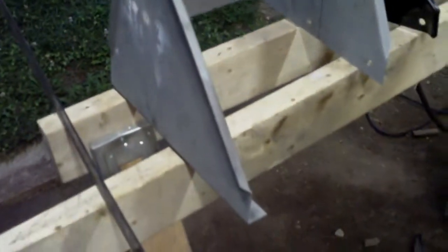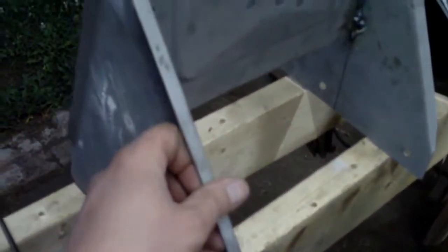I will say this much — this 14-gauge steel here was a little too much for my box and pan brake. It's only rated for 16-gauge, and I really had to ream on it. I hope I didn't go and bend something.